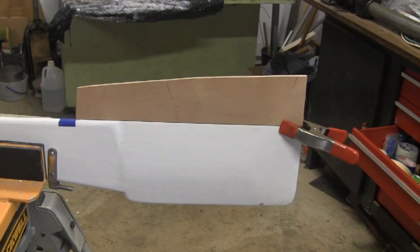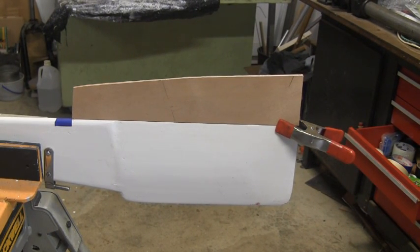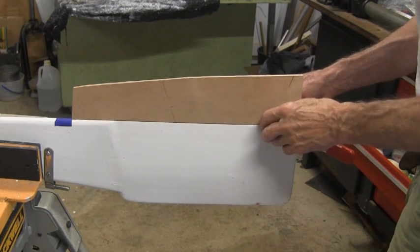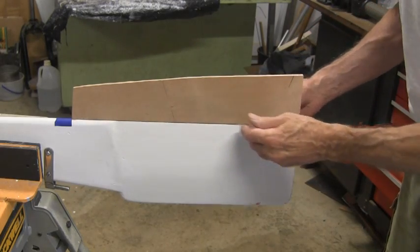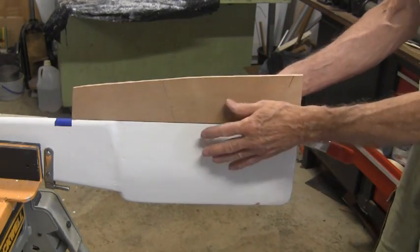I think I've got my piece cut and more or less shaped, and that'll give me probably the amount of extra surface area I need on the rudder. It will be set about a half inch, maybe three-eighths, into the existing rudder, and then I'll probably take some two-mil material and build up along the edges here — clean all the paint off and epoxy it on — then fair in the new piece.